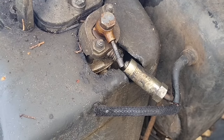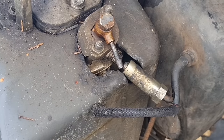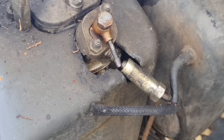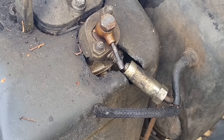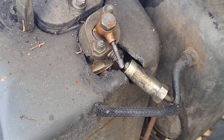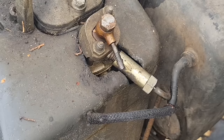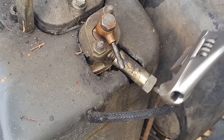Where's that decompressor? Wow, we're getting a spit of diesel out there! That's a good sign in a way, not a good sign in the other. Can you see that we're getting spits of diesel out there? So that tells me the diesel pump is okay. Now just turn the rack the other way and we shouldn't get anything now. No — so that's off that way. Okay, so on is towards me. We're getting diesel creaking out of there, but we aren't getting an injector creak.